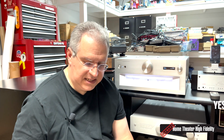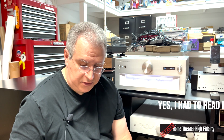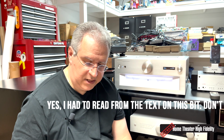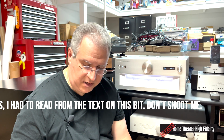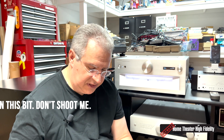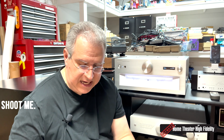Really, digital. Technics claims that all analog incoming signals are converted to 24-bit 192 digital signals by a high-quality analog-to-digital converter chip, courtesy of AKM. From there, all signals are then upconverted, manipulated, amplified in the digital domain, and remain digital through to the output at the speaker level. There is no digital to analog conversion at the output.